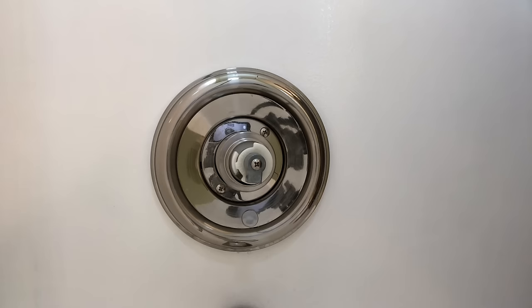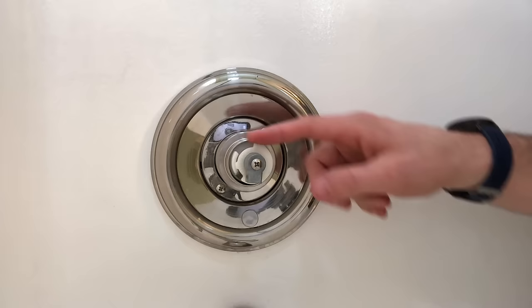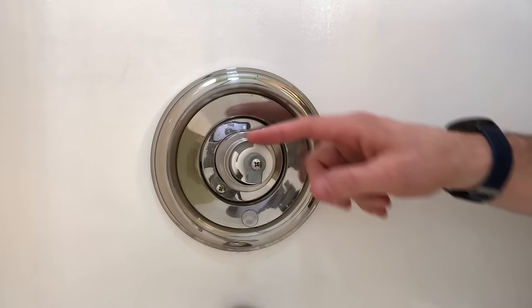Your water heater should be putting out about 120 to 130 degrees Fahrenheit, so if you're only getting about 100 at the shower you can probably easily adjust one of these adapters. Even if it isn't a Delta, it's going to be something very similar that limits the range of motion. Do be careful though - if you have children that use this shower or bathtub, there's a reason these are on there, as it can prevent scalding and is a safety issue. That's it - that's how you adjust the hot water setting on a Delta valve.